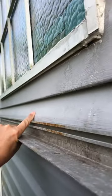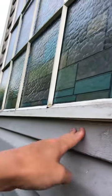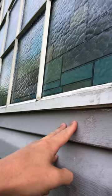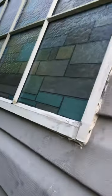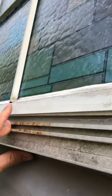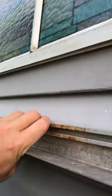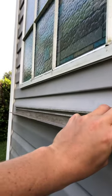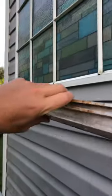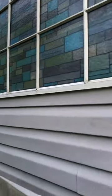See how there's a lip on that window? If you were to just put the railing right on here, it's gonna crush it and go right in — that's not good. Plus it's gonna sit too far in from where you need your shutters to tie in, so you'd have a ledge and a lip there — you don't want that. But when you have it on the piece of wood stuffed in there already, that one by two, it's gonna keep it sturdy enough to put your hurricane shutters in and should work for accordion shutters as well.